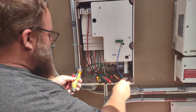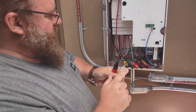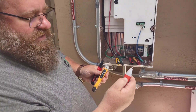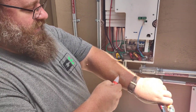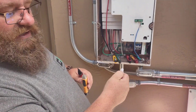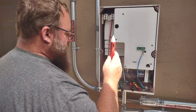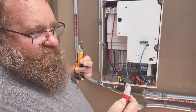Another thing I'm really against is any voltage detector that doesn't show me that it's on. There are a few versions out there that don't tell me they're on. This particular one doesn't have any indicator — when I hold down the button, it doesn't tell me the system is on until I actually do something. One thing I always do to check is rub it on my hand and listen for it to go off. Out here where it's sunny, I can't even see the light, so that sound is critical. I never want one that doesn't have a light telling me it's functioning.